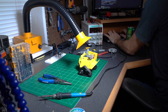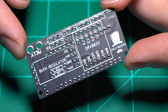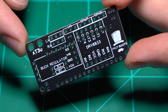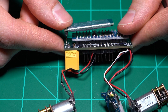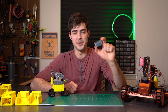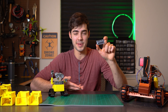Baby Wally 1.0 was a wiring nightmare and I was constantly taking it apart to reconnect wires. To fix this I designed a circuit board for small robotic projects just like this that has outputs for 5 servos and 2 motors as well as all the electrical components. It pops right onto the main housing and makes connecting everything so much easier and so much more reliable.